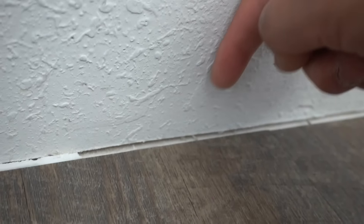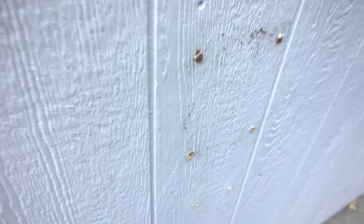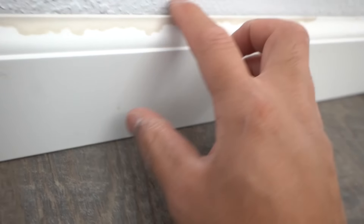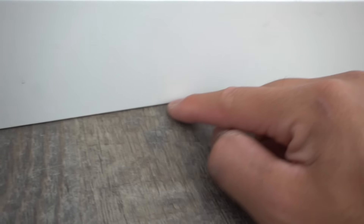What if this wall is your outside wall — the wall that faces outside your home? If cable was drilled through and those holes or gaps weren't filled, bugs and spiders could come inside your wall and start coming out here. That's actually an experience of mine — bugs started coming out of here, spiders and whatnot. If your baseboard is installed but not caulked, ants and bugs could make their way out of this hole. By caulking this gap, you will have no pests coming out of these crevices.